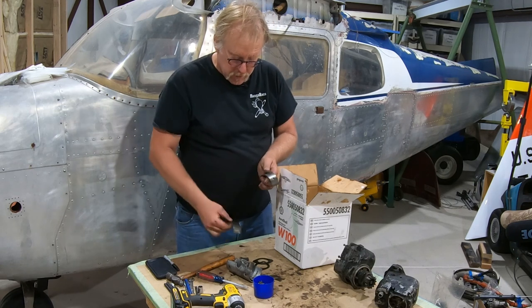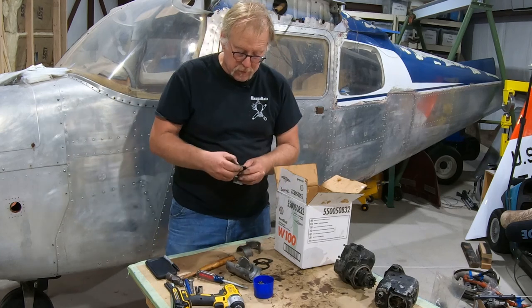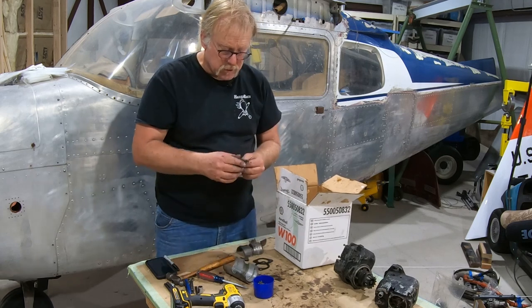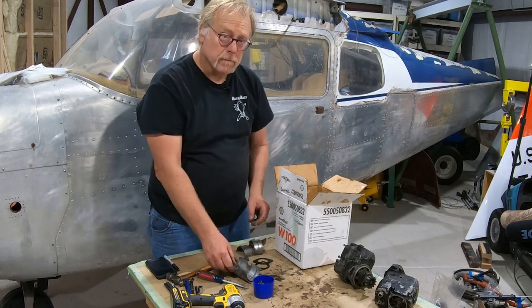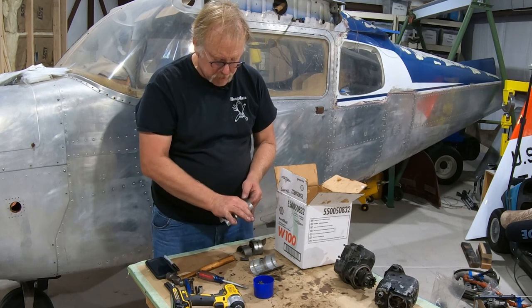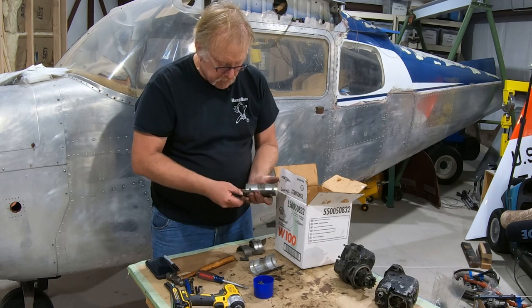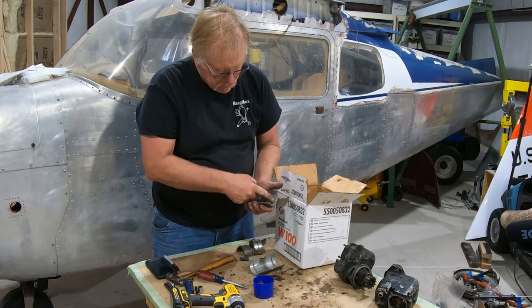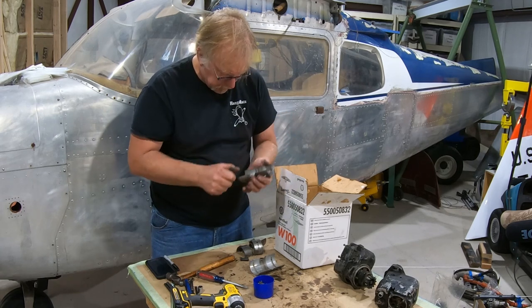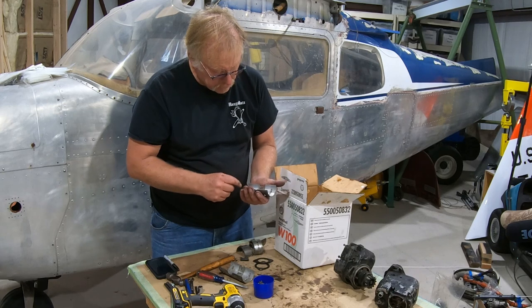I'm looking at a little fretting going on, but it looks like it's clamped pretty tight. These are so tight, it's kind of tough to read the part numbers. These are 3/1000ths undercut. So the crank will probably end up getting a cut. You can see here some fretting going on and all that. This is the outside. This should stay put. This is the crankcase split line. So it really doesn't look that bad, but I am seeing some debris. There's actually some shitty debris. I don't know what's going on there. Kind of impaled on that. This one has more rubbing in this area here. This actually looks pretty good.